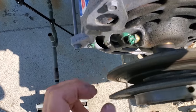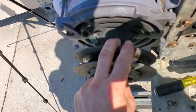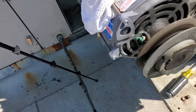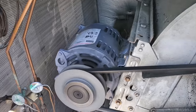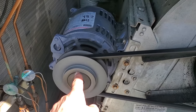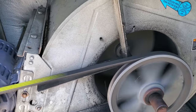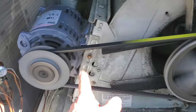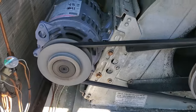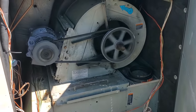Those bearings were dry — I pushed grease through and all that came out was new grease. I didn't even push out any old grease, so those things were completely dry. Much better now. The motor pulley is going bad, so the belt's kind of riding funny in there, but the bearings sound good. I don't hear that grinding sound coming from there anymore. That's just the belt. We'll talk to them about putting a new pulley on there. We might have gotten some more life out of that.